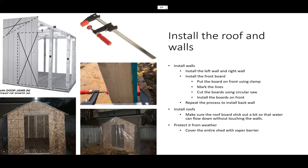This section is saved for the doors. I used a clamp because at the time I was doing this alone, so I used the clamp to hold the board and framework together. That way I could mark everything, then put the board with the marks on the floor and use my circular saw to cut it to the exact shape.